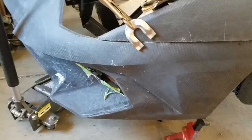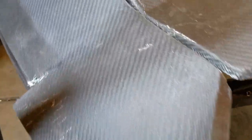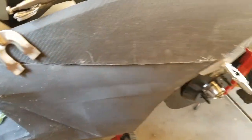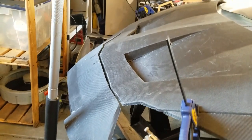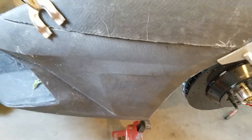Here's the part out of the bag. I still have some pieces to take off, but most of them are in these little areas — you just have to slowly chip those out. Mostly the carbon fiber comes out nice. You see a few little scratches here and there, but those can be sanded out. Don't worry about scratches from the screwdriver and X-Acto knife — those will come out when you coat the part with epoxy resin afterwards and you'll get a nice glossy finish. There's a little bit of distortion on this piece, but nothing that can't be handled by the way we mount it. The next thing will be to gap everything and get it prepared for paint.